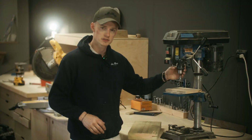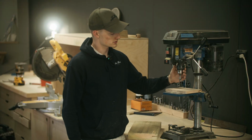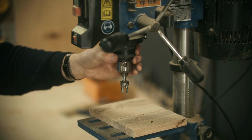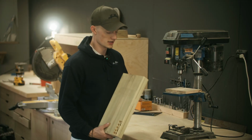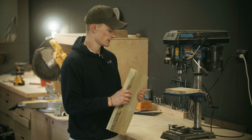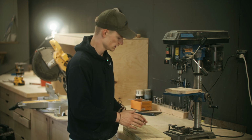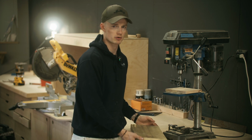Now we can make the plugs using the plug cutter on the drill press. So we got a 13 millimeter plug cutter here, and I'll make sure to link this down below in the description, as well as the other tools and accessories that I use in this video. So I'm going to use a leftover scrap 2x6 or 2x8, and I'm gonna make probably like 30 plugs because we're gonna use them later for the benches as well. I'm gonna make 30 holes, and then we can cut the plugs loose afterwards on the table saw.